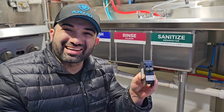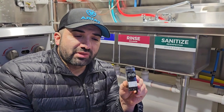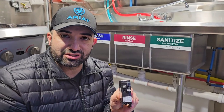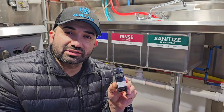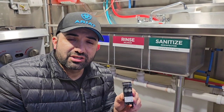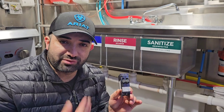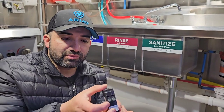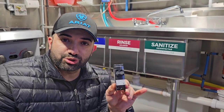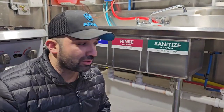A quick electrical hack worth mentioning: this is called a tandem breaker, and I link it in the description. Instead of a regular breaker with one toggle, this one has two. This is very beneficial when building out your food truck and you want to add an extra circuit. On the small panel I use, instead of two circuits you can now have four, because two tandem breakers each carry two separate circuits. We use this a lot in the field as well.